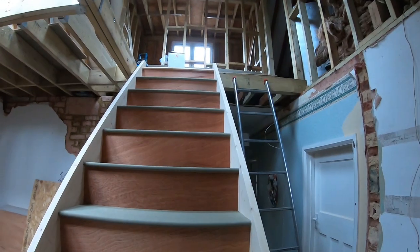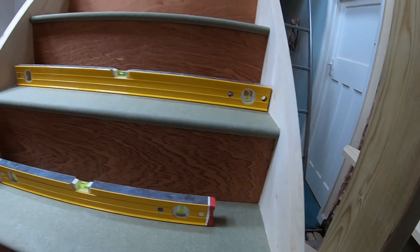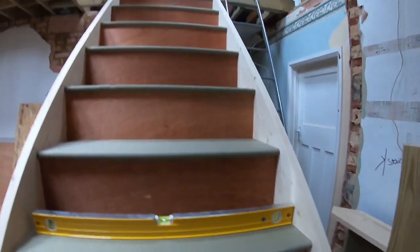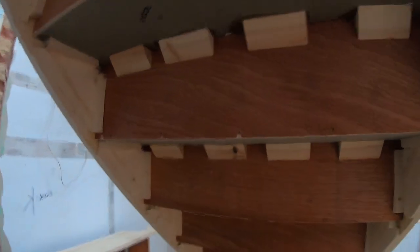We can screw the top now into the trimmer through the front face of the plywood. So we've got trimmer there. So we'll do that, and then we're gonna work on this part. We can show something. If you ever have a problem with squeaky, creaking stairs, these are the blocks you need to put in, a stick that stops that and that moving, so they lock themselves in, and then obviously the screws here hold the riser. So that's what you need to check now.